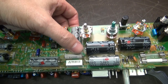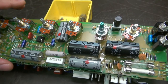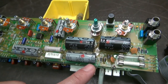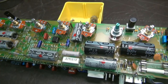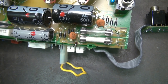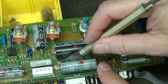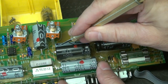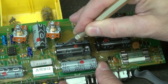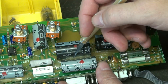Now let's attack these capacitors. I'm going to take them off one at a time and carefully cut this glue and try not to hurt the board in the process. I've propped this board up on a little plastic tray to support it while I'm pulling these caps, so that I don't stress those brackets underneath and crack the boards. So I'm going to start with the big 47 microfarad caps. I'll take my exacto, cut the glue, and try to pop them off. As I suspected, this glue is some pretty tough stuff — it's almost impossible to slice through it. So what I'm going to do is slice this covering on the electrolytics, let that peel away, cut these leads, get the cap out of the way, then work on just getting that plastic coating off of the adhesive.